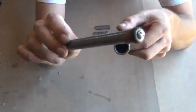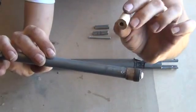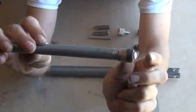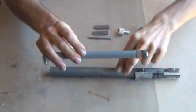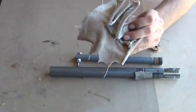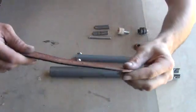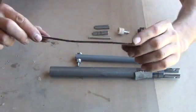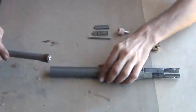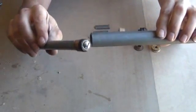The pump head is basically a wooden circle — the inside wooden circle from a hole saw. I pull the inner little chunk out of my hole saw, and that's the back brown part at the tip of my finger. The front gray pieces are cut-out pieces of leather from two sources: one is an old glove, giving me three pieces of really thin leather from the palm, and two pieces of thick leather from an old belt. Once you cut that right, it makes a great seal. The old Benjamin Daisy or Benjamin Sheridan air rifles used that leather piston head as their pump seal, so it works very well.